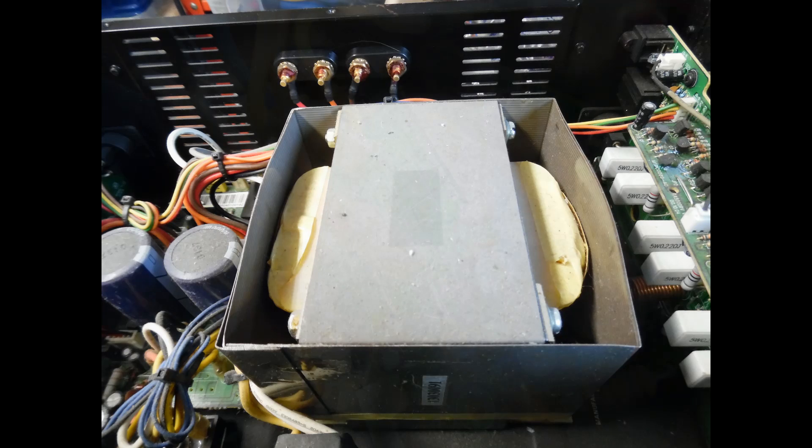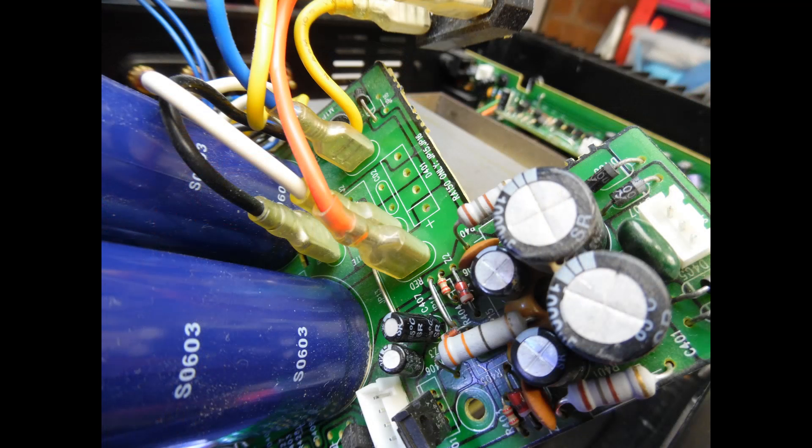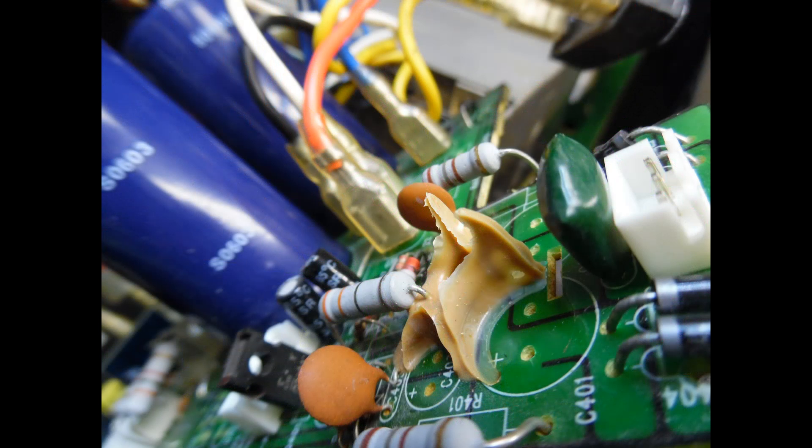The next thing is the top of the power supply board, where you can see brown glue — probably the first time I've seen it on the RA500. This is a very common thing seen in amplifiers of a particular era. The manufacturer's thinking was that this brown glue would provide additional mechanical support for large components like the smoothing capacitors. The problem is that over time the glue dries out and becomes conductive — not 100%, but enough that leads or components which should not be connected together start to conduct, causing issues.